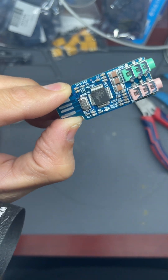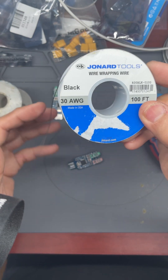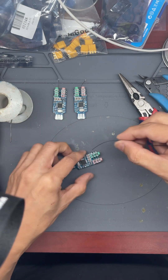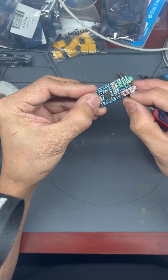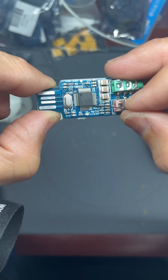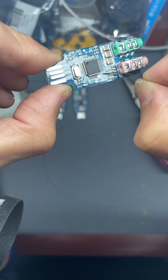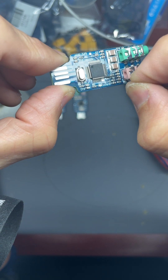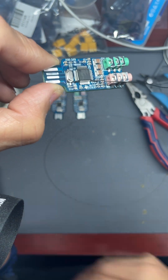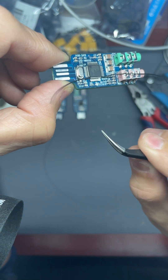The first thing I do — I have this 30 AWG wire. I put it in between, just below the IC. Let me show you. See, I just put it here; the end goes right in between the IC pins on the board. Now I can pull it out — there you go.